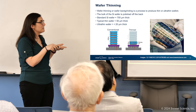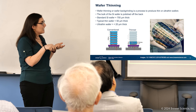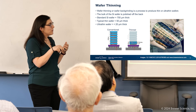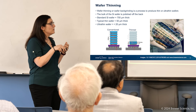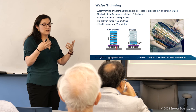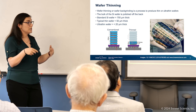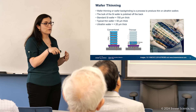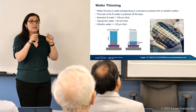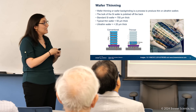Here's a demonstration of the space savings. You have one, two, three, four, five, six chips that are all stacked onto this landing die — all connected, all full thickness, connected by quite large solder bumps. In this case, what we've actually done is thinned down all of those chips using a different type of interconnection technology, and now you have the same amount of essentially computing power but in a fraction of the space. This is really the power of semiconductor packaging. As we thin the wafers, especially below that 50 microns, they lose their structural integrity — they almost become like foils and curve up like Pringle chips.